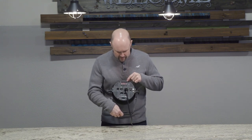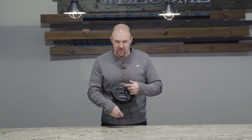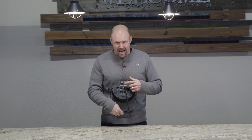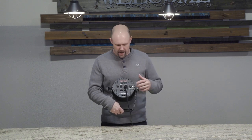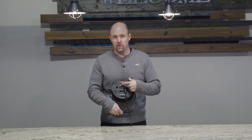In this case, it's showing my DMX channel — DMX 261. I can choose up or down to change that particular number. I can also press the menu button to access different features in the light. This light has a six-channel mode, a seven-channel mode, and a 12-channel mode, and each one of those provides different kinds of features.